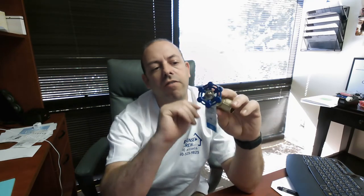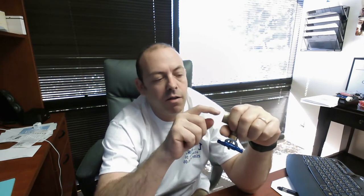This is a gate valve. A gate valve is basically a screw — when you screw it to the right, you're shutting off the water; to the left, you're opening it. The issue with the gate valve is that you're screwing and screwing and you're not really sure if you've hit the end until you actually test the water. Then you get to a point where you can't even turn it anymore, but the water is still flowing.